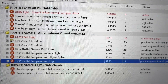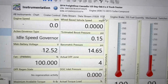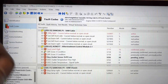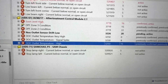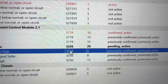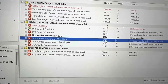Something may be preventing the regen from completing successfully, which means the truck is going to be at DPF zone four or zone five. You'll get stop engine lights, check engine lights — it's pretty much going to light up the cluster. But don't just look at the top code and think you need to do a regen. Look at the other codes at the bottom. With this one, you're looking at fault code 3250, with FMI 0, FMI 8, and FMI 15.